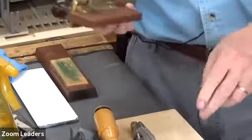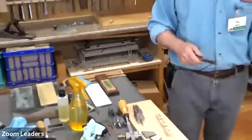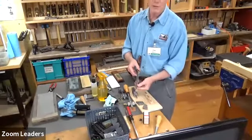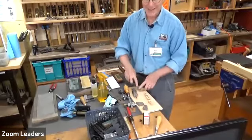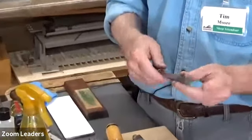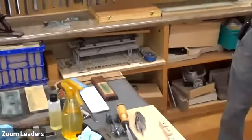I was having a hard time until I got one of these. I really couldn't make this particular plane work. They come in pairs, and there are some other things that use, I think, 18 degrees or 30-degree skews. It helps in doing a paring chisel like this, although this chisel, I just ground freehand and then honed, as I said, like this. And that gives me a very sharp edge, because I want this much less than 25 degrees. I don't know what it is, 20 or something. It's a very delicate edge, but it's really great for taking off little bits of wood.